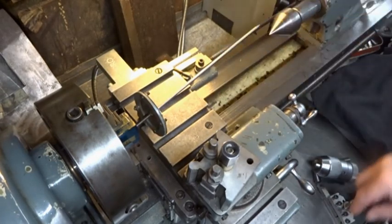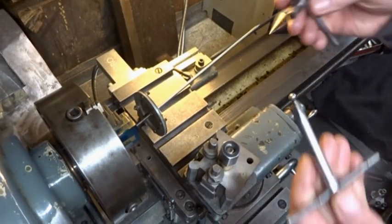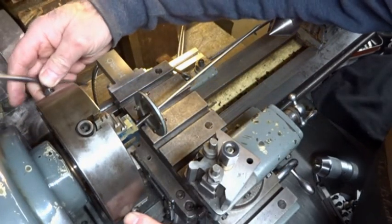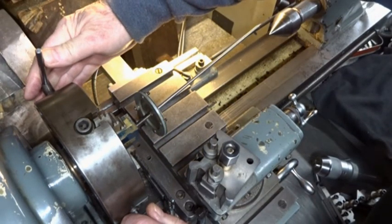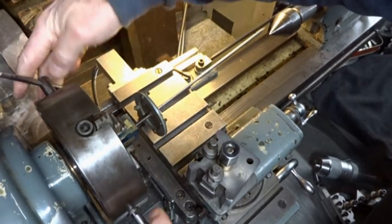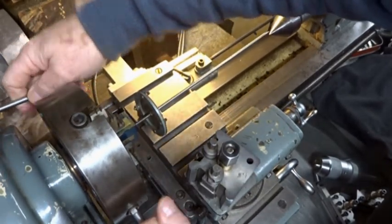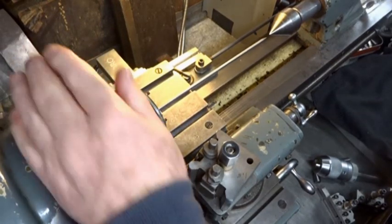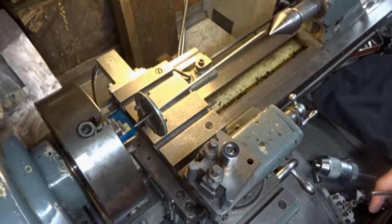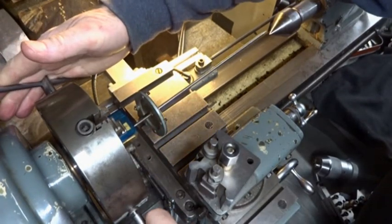The plan is to adjust matters so that at this point it doesn't really move when the pop is aligned with the centre of the lathe. So here are my two keys — I've got some little bits of brass in the jaws to stop damaging the work — and the idea is to just slowly adjust the thing around to try and get matters in line. Already you can see there's been quite a large improvement with very little effort. I do find using two keys to be quite handy.